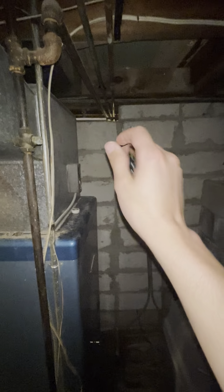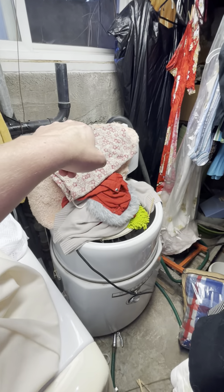We'll need a pump-out drain from this side or a little bit behind this unit. Behind here you can run a drain line just up and over this wall right here, kind of like you can see with the softener. There's a floor drain right here. You also have a drain line that's freely accessible right here that goes into the washer — it's got its own tee. You can go into that, and you'll be coming just right through there. Either way is completely fine.